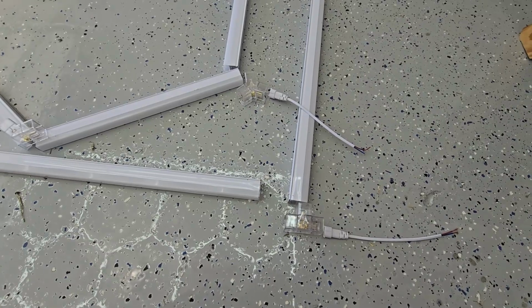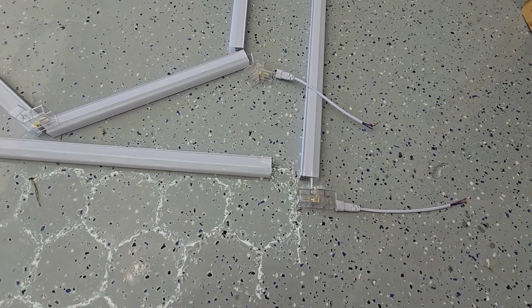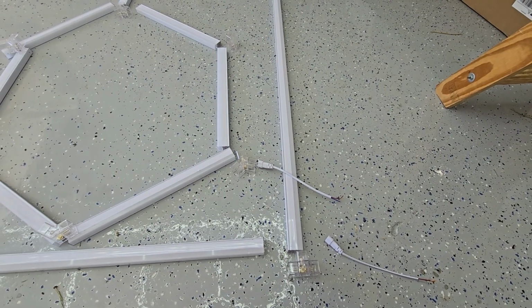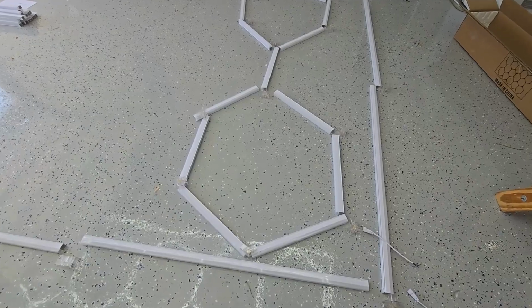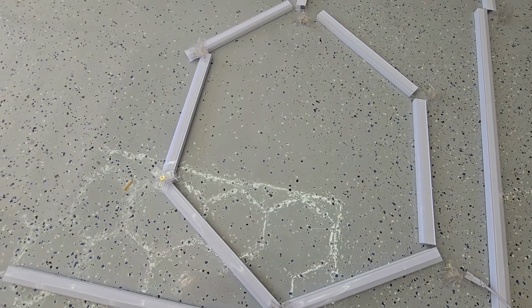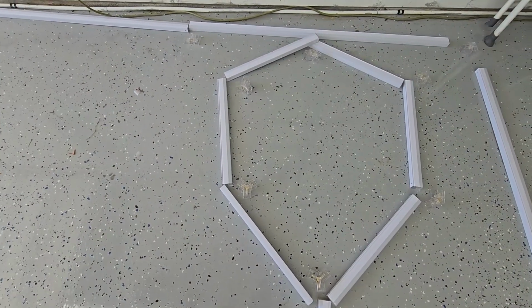You can see we have our two 3-way connections here, even though it's a 2-way connection right there, but we're using the third to install these wires. So these two are going to get spliced together, and one is going to get a third splice into the already existing wire. So whenever I flip on the garage lights, it's going to turn the lights on. It's going to make your life a lot easier if you go ahead and lay out these connections where they're going to go, because during the install, you don't have to be figuring it out. You're already doing enough stuff while you're sitting there sticking all this stuff to the ceiling. So having the connections all out and ready is going to make your life a lot easier.